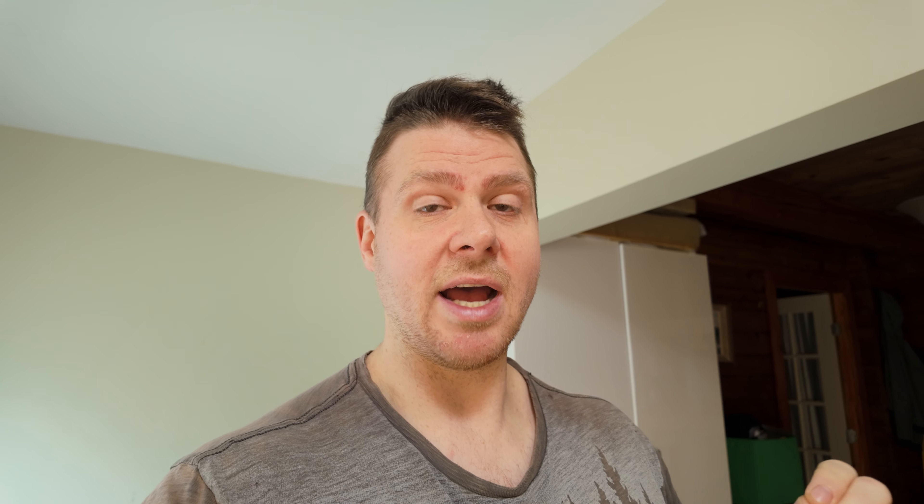The battery percentage display on this charger isn't very accurate. If you want an accurate reading you need a device that measures input and output current, which gets more complicated. There are also other videos online where guys use a booster module that doubles the voltage, and you can get a higher charge speed — as long as the unit you're charging can support it. You can also double the voltage from 12 to 24V by connecting two LiTime batteries together. If you don't have a power station like EcoFlow or Bluetti, you can just buy an inverter to convert the power straight out of the LiTime.